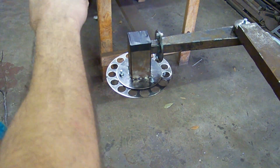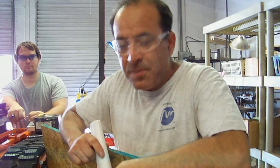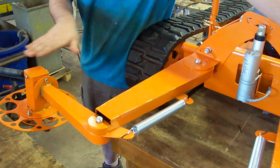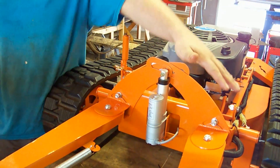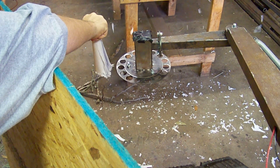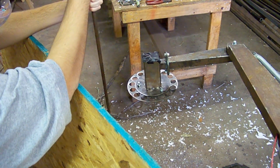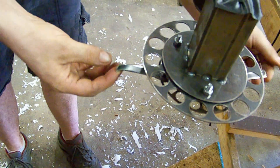Of course, no success is without its moments of failure. One of the cutting blades broke off of the system, and when it broke off we could see vibrations because it wasn't balanced. So we noticed there was something wrong. It wasn't easy. But we don't do things here because they're easy. Time and time again, we kept making adjustments as needed. We changed the rotation of the high torque motor. Before, we had a horizontal actuator which increased the width of the arms. After consideration, we determined that a vertical actuator to adjust the height and angle of attack of the arms was probably better. Until finally, we were able to obliterate rolls of paper, tear through a tree branch, and even chip away some steel. The blades are a little deformed just from the metal bar test, but that's normal.